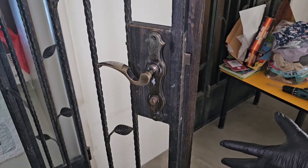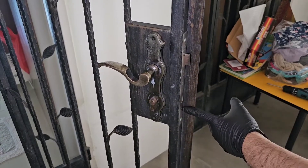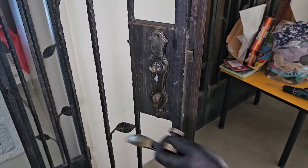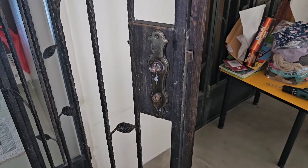So here we have our gate lock. We have two screws which hold the face plate together, and this is actually the screw which you need to remove the barrel if you want to change your key to the lock. This one is broken — over time it has broken due to corrosion. So we are going to change this today.